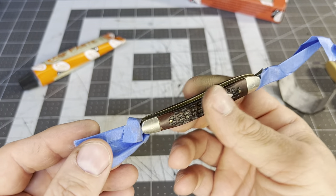I'm doing this lightly — you don't have to push hard. Let the sandpaper do its thing. Now I'm putting a bit more weight, kind of doing this number to get that tang. If you do it too hard you'll tear the paper, so I'm being easy. I take this right here and just come back with it. The reason I'm doing it this way is so I don't end up with lines going in all different directions — if there are lines, I want them all going the same direction. It'll make it look nice and factory-ish.